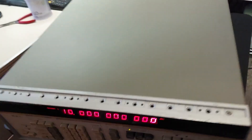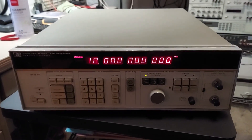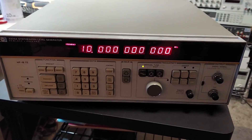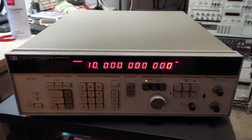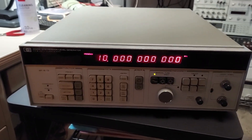Thanks for watching. I'm glad I got this thing working. Trying to find these on eBay can be a bit of a challenge — some are in fairly decent condition, but unfortunately a lot of them have seen pretty rough service and have problems. I've got a parts unit I bought that has the newer CPU in it; everything else is the same, but it doesn't have the same high-stability option that this one originally had, so I couldn't rob that one. At least I had a spare 10811 laying around, which is actually a little bit better than the one that was in there anyway. Thanks for watching — we'll get some more videos up soon.